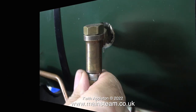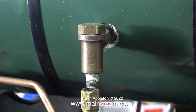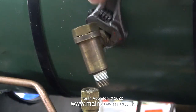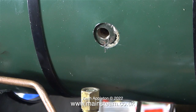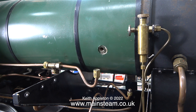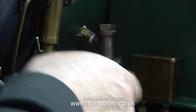Around the other side of the engine, I've disconnected the piping from the side tank. Before continuing, I wanted to remove the check valves. This is the check valve on the other side where I've removed the tank. I wondered why the check valves were built like this, with the inlet to the boiler part at an angle — it became obvious that they were made this way so you could unscrew them without fouling the side tanks or the saddle tank, whichever variant was going to be used.